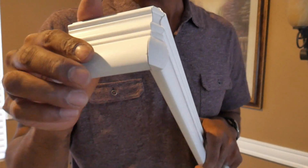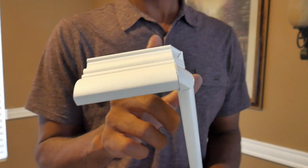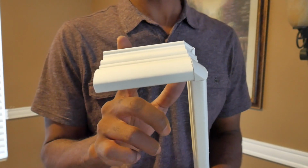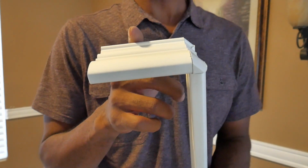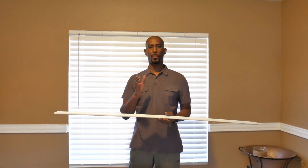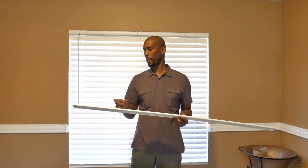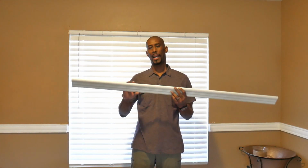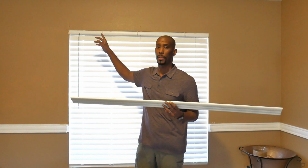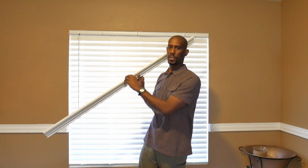and then you have a decorative end piece. Now, depending on how far your wall is, you will need to cut it, but let me show you what it looks like when it's all finished. Now, before you put your balance end clip in and the balance end rail, you want to attach the balance to these little clips. It's real simple. You just put them in from the top and you slide them on down.